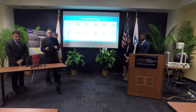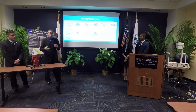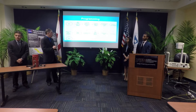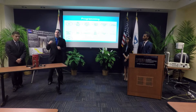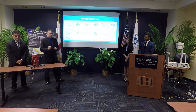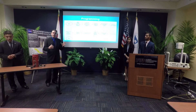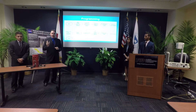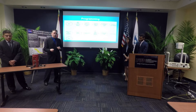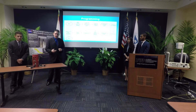We then looked into Mission Planner, a graphical user interface also part of the ArduPilot project. We had some contact with Michael Oborne, the designer and creator of Mission Planner, but it turned out to be too limited for the specific things we wanted to do. We knew Mission Planner could read Python script, so we looked into writing the program in Python, but ran into another major bottleneck: the specific line of code for entering land mode simply turned the motors off. We tried to resolve this in a few different ways, and finally took it upon ourselves to write our own land mode procedure. We made good progress but unfortunately ran out of time.